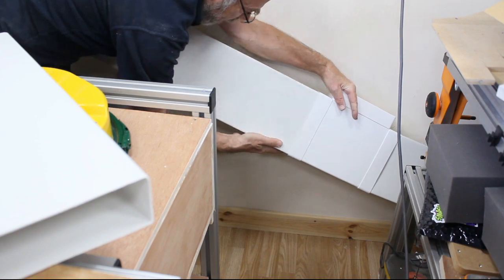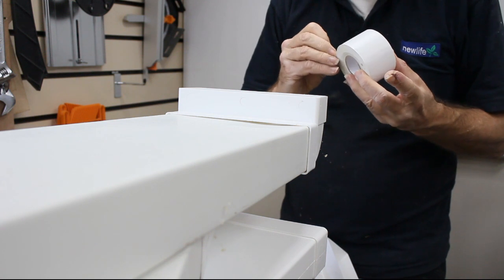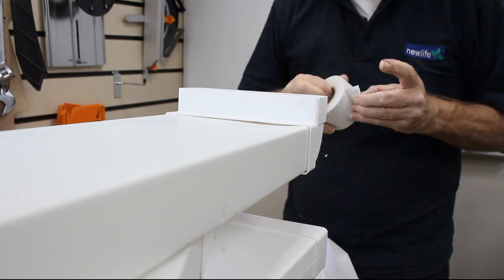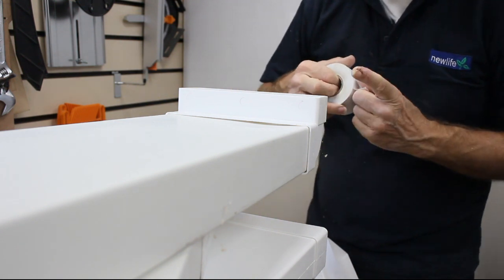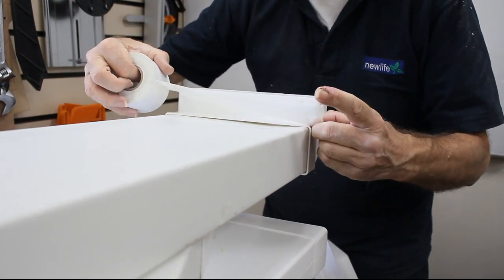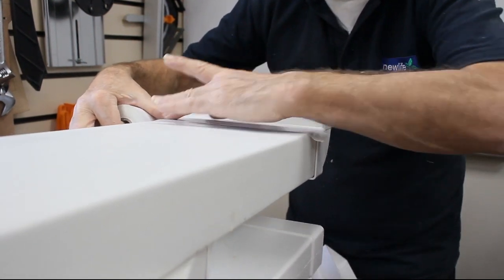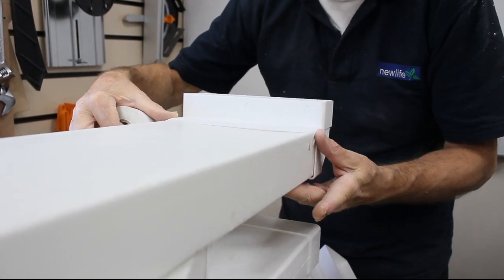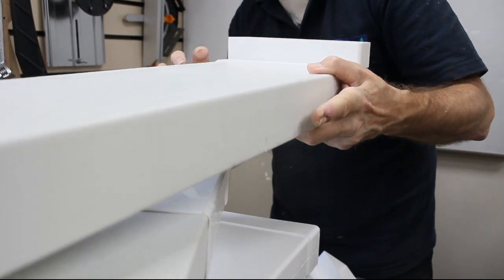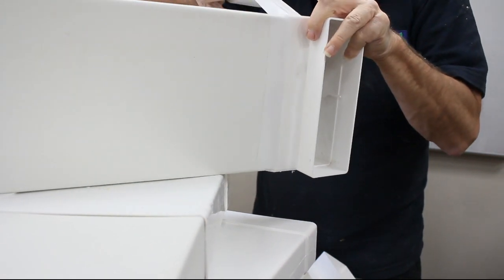This is the tape I'm using — it's just a very thin PVC white tape. It's got a certain amount of stretch in it, so you can pull it taut over the joint and it'll pull itself down to follow any changes in level. Things smooth in nicely and it just gives a nice finished joint. Hopefully that will then give us what we need.